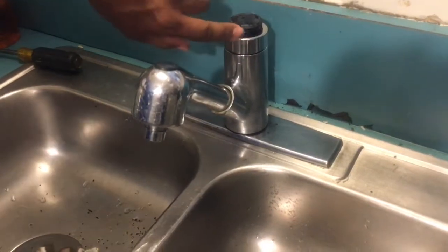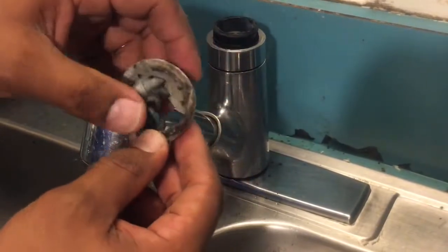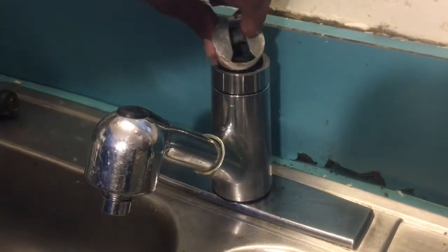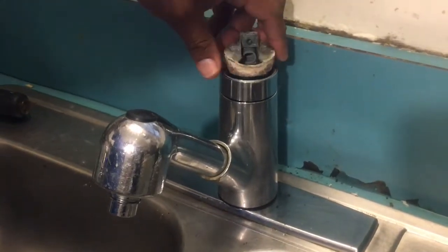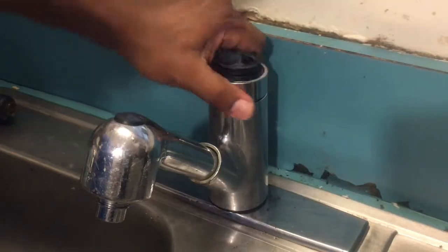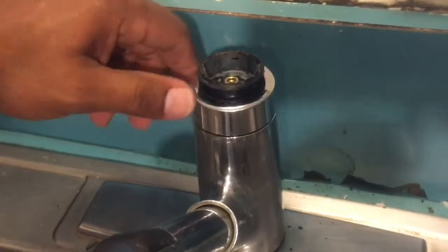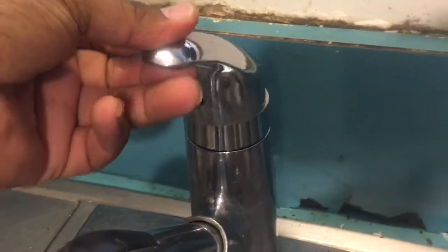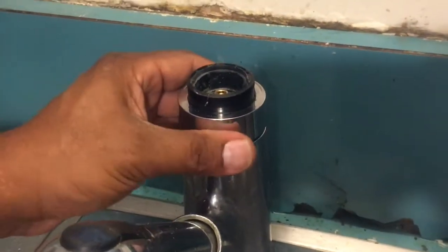And basically, what you want, you see these grooves back here, that piece of this faucet, which we're gonna screw down in there, that little piece in there has to glide in there, it has a stop that way and it has a stop that way. So it's essential that this is placed in the back that way, not up here in the front like that, because then your handle is going to be facing that way. If you want your handle facing this way, that groove piece has to go at 12 o'clock on the back side.